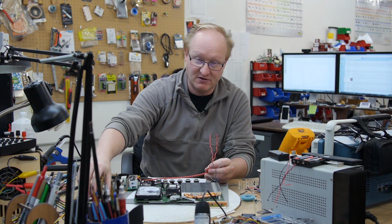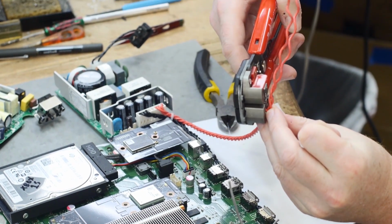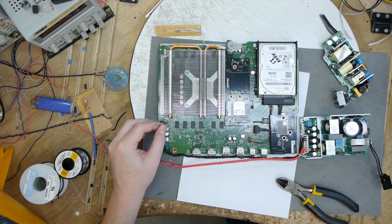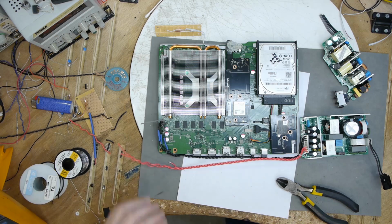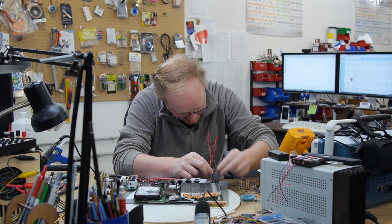That's just what they had on their power supply. You can go online and look at the current carrying capacity of wires. Basically, it'll tell you, based off the wire's AWG, American Wire Gauge, number, how much current it can carry safely. Again, they probably went over. It's always a good idea to think high and then double it.